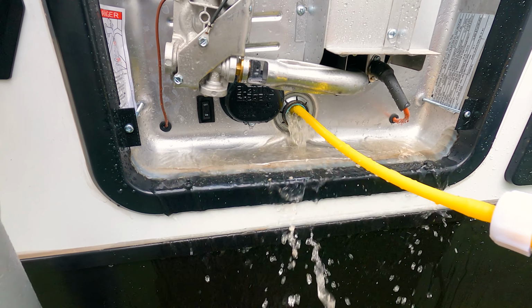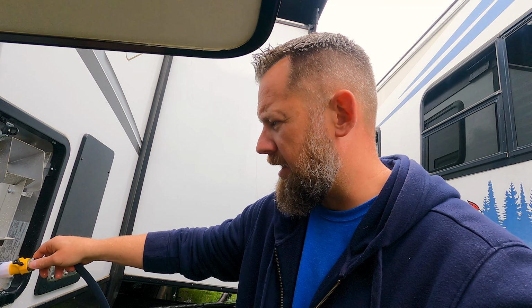Well, it is like going to the dentist's office, isn't it? I'm not going to make you watch the whole thing, but I'm going to scrape this in and out for a while until the water comes out clear, and then we'll replace that anode rod. Don't stare at me while I'm doing this.